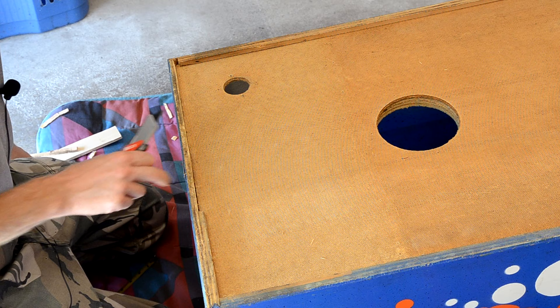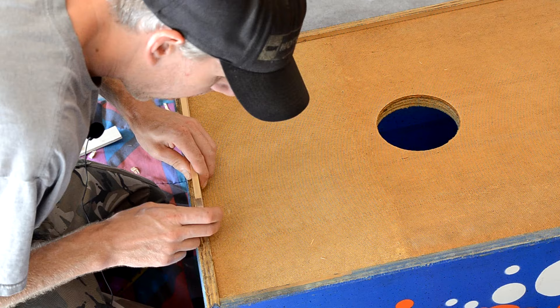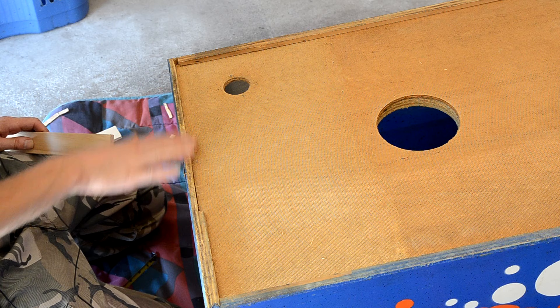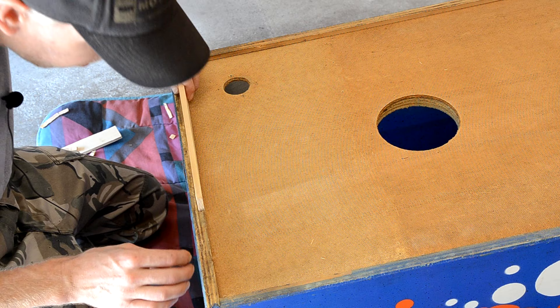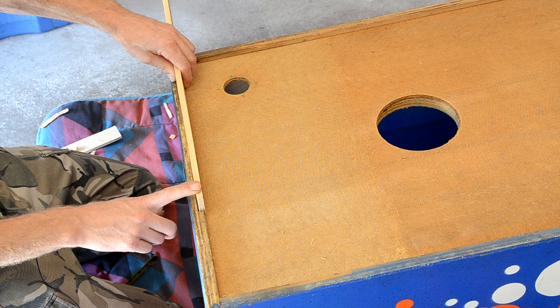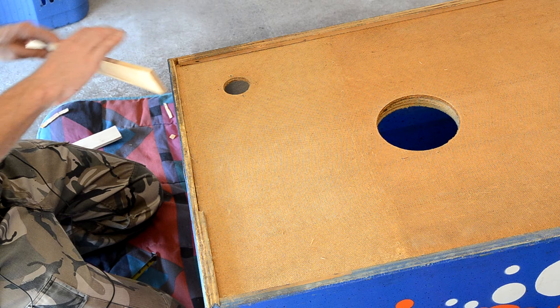I used a sharp utility knife and trimmed away all that broken piece, squaring off a corner. Now if I line up my poplar strip it's perfectly in line with the remaining pieces. I just need to trim this piece down to fit, then clean up all the loose pieces, sand the surface so the glue has a nice surface to key into, glue the piece in, and trim it to height at the end.